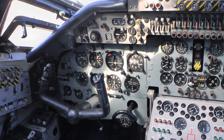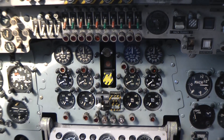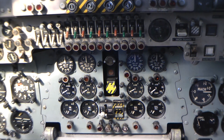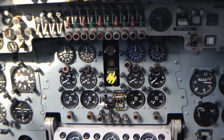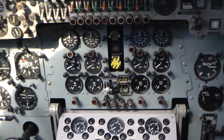In the middle, the red and green switches are the power flying control switches. As I mentioned earlier, you've got two independent systems per flying surface — one running off a port system, one running off a starboard system — so they're completely isolated systems doing the same job for fail-safe.